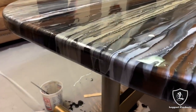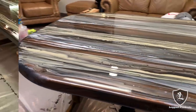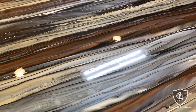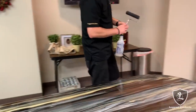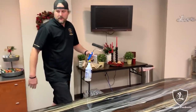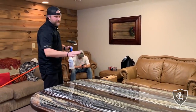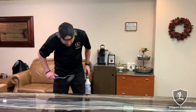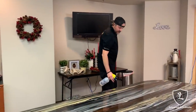You can see how it's all leveling out — all the spots where I pushed it away are starting to fill in. We've got a good thick enough coat, it's going to all level out. Now, 91% isopropyl alcohol. These tables bow in like this so there's a seam here, and a lot of the product runs from the edge down to fill it in. I don't want to spray a lot of isopropyl on those thin edges because it can separate it and bring it down to the primer, then I have to take time to fill that back in. So I'm going to spray it really light on those edges, and I'll do a test spray to make sure it's spraying how I want.